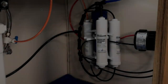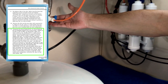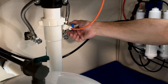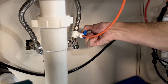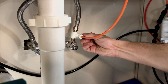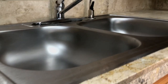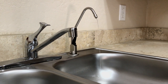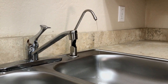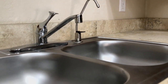First, make sure the unit is dry and double-check that all the valves are in the closed position. Once you've done so, slowly open the easy feed water valve, also known as the angle stop valve — very slowly, as you always want to reintroduce water back into the system at a very slow pace. Water should flow normally from your kitchen faucet and you should hear water flowing through your system. A trickle of water should be present after 2 to 20 minutes. Once you observe the trickle of water, close the lever on the RO faucet and allow the system to pressurize. When the system is pressurized, it will shut off automatically.